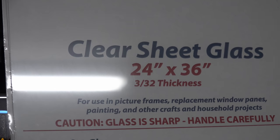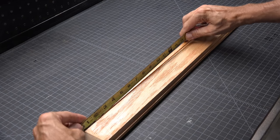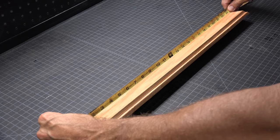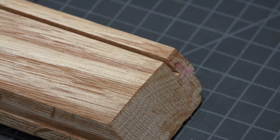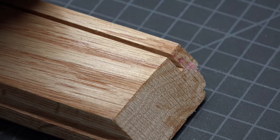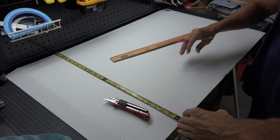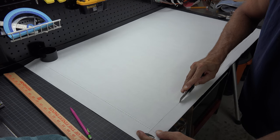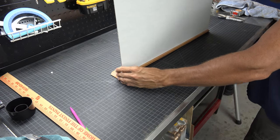If you are a subscriber and you have watched me work with glass before, you are probably thinking — is he going to try this again? But since it's only two cuts I would give it a try, and yes I have the backup plexiglass at the ready. Take your bottom piece and measure out from the end of your glass groove from one end to the other. Ensure you use the bottom of the groove and not the top or your cut will be short. Just to be safe I used the cardboard from the back of the glass packaging and cut it first so I can check the fit and make corrections. You only get one shot at this so your cut must be precise.